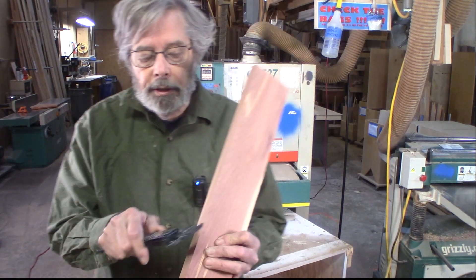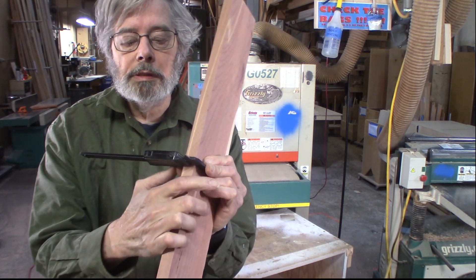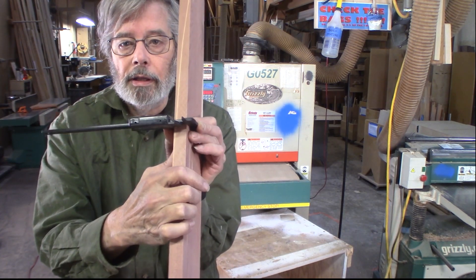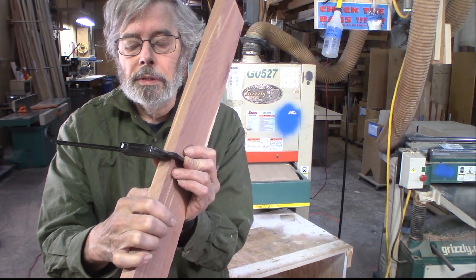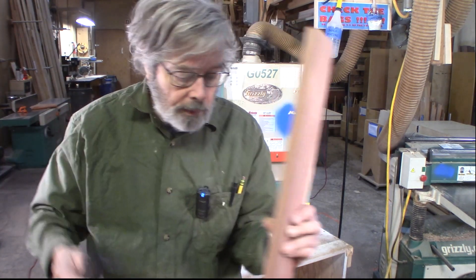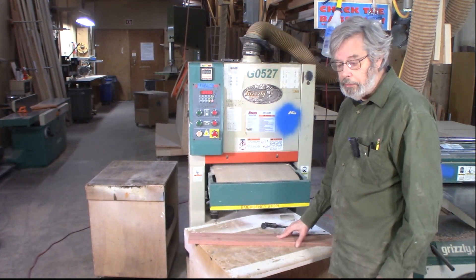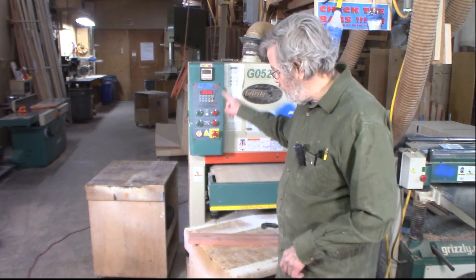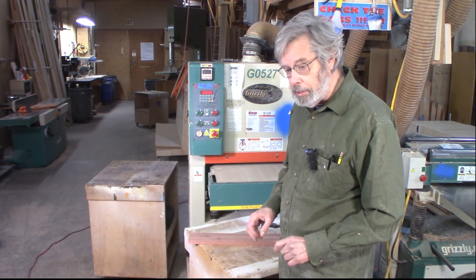The accurate way to read this is to grip the calipers and make sure they're 90 degrees — you'll read a very different dimension when it's crooked. You wiggle it, and the least dimension is the realest dimension, because that's most directly 90 degrees across. I like to start with what I actually read, even though it may not sand, because this is calibrated — sometimes someone destroys the calibration and puts it back, and I don't trust it to be right.